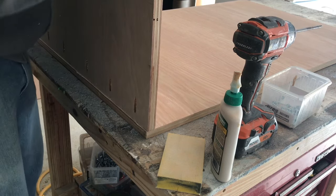I'm using edge banding or veneer edging. I bought this at Lowe's to match my plywood. What edge banding does is it takes that plywood layered look and makes it look like a finished piece — you've got the same veneer. You need a flush trim bit on the router to get that little lip off, or a good steady eye and a utility knife. That's what we're doing now. I've got one more to do and it's looking really good.